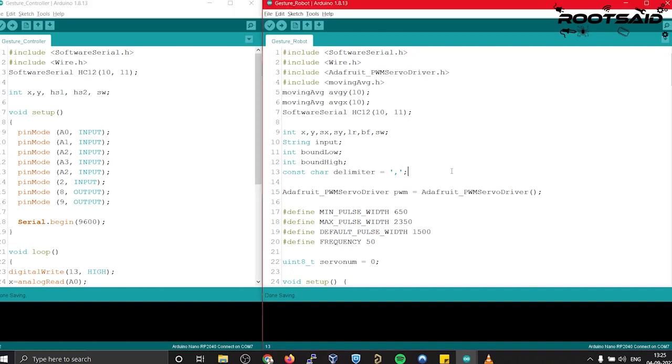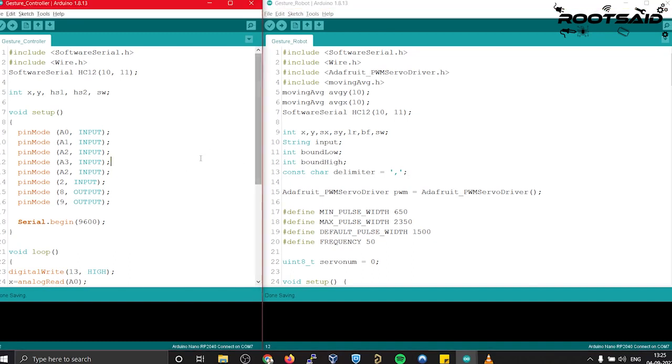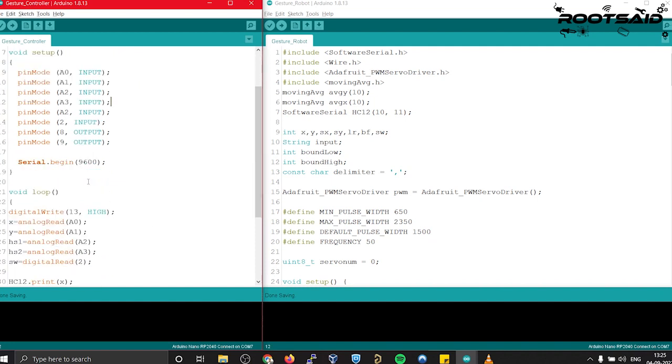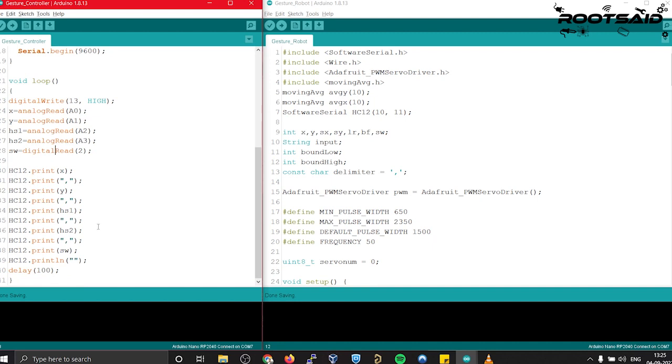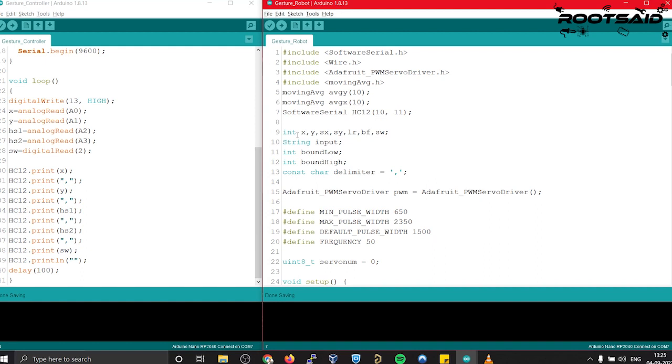Now, let's take a look at the coding. I will share the code of the remote controller as well as the robot in the description down below. In the remote controller part, what we are doing is we will be collecting the inputs from the accelerometer, the Hall effect sensor, as well as the switch and store it in different variables. Once we have done that, we will be converting them into a string of values separated by commas. Once we have constructed the string, we will be sending it to the HC12 wireless module. This HC12 wireless module will be sending this data to the HC12 wireless module in the robot.